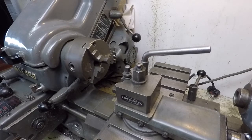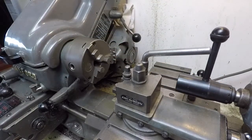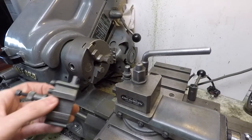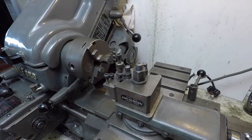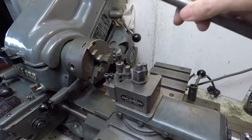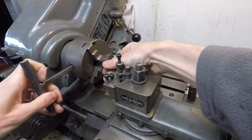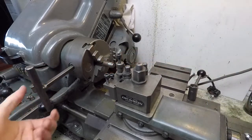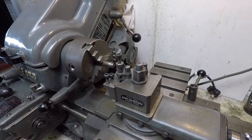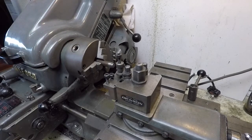So we've come over to the lathe. We're just going to get the lathe set up to make our stub mandrel. First thing we're going to do is stick the tailstock die holder into the tailstock. Got our turning and facing tool which is going into the quick change tool post — just tighten that up. Here's our piece of metal; just any old steel will do, ideally something that's free machining and easy to cut. Just plug that into the chuck and tighten it up. We've got about an inch to an inch and a half of material protruding, which is about right.